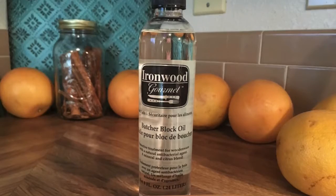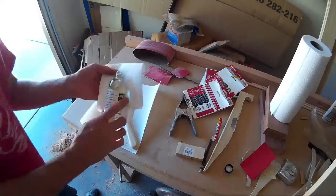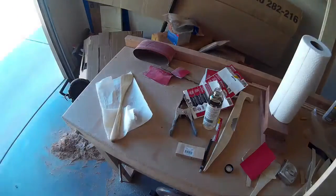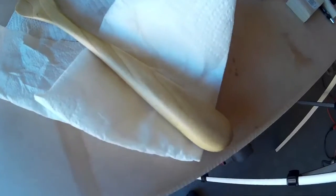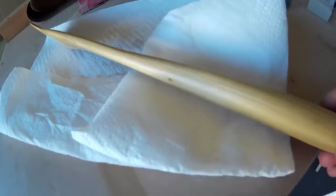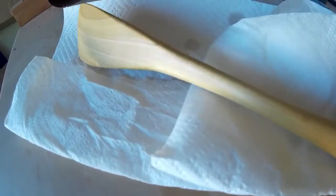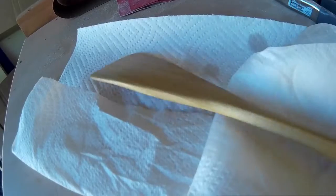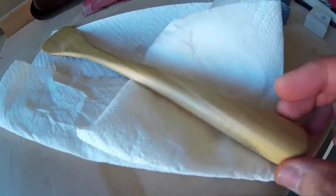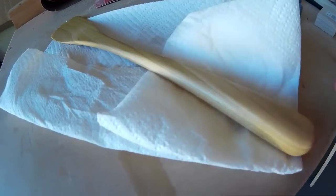Scraping with the razor blade is equivalent to using like a thousand grit. Here you see the butcher block oil I'm using to coat the spatula. It's ironwood from Australia, my wife bought it on Amazon. I'm not sure of the quality of the product, but you can see how it looks with the poplar being oiled with the butcher block. I let it dry for a little while, and while I waited I made sure there was nothing obvious I needed to go back and sand, because the oil will bring out details you didn't notice before.